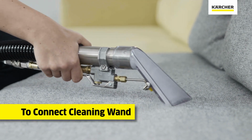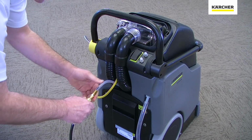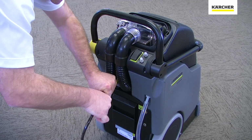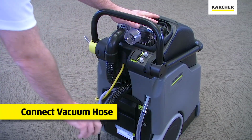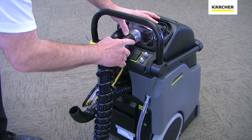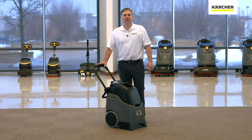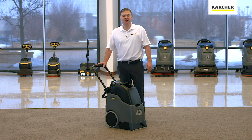When desired to use a hand tool, remove the small braided hose. You can use that male end to the female end of your hand tool. You will then take the large black vacuum recovery hose and place it inside the clear recovery dome on the right side. Well, thank you for watching our video on the operations and maintenance of a BRC 3015.